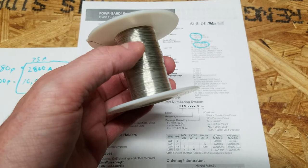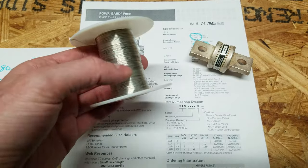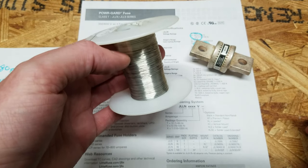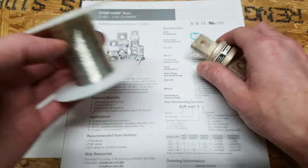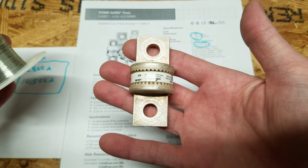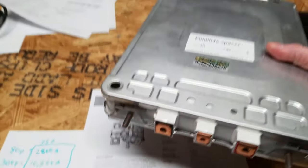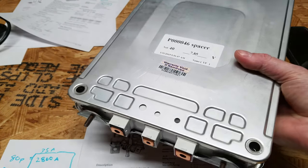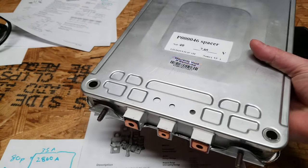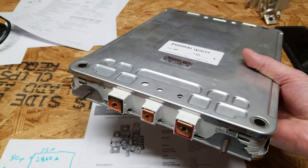You may be asking: why isn't that thin fuse wire good enough, since those fuses would blow before the main fuse? That fuse wire should never be your first line of defense in short circuit protection — you need a properly sized fuse as your first line of defense. It's also important to remember that not everyone is using 18650 cells; some people are using big EV batteries like a Nissan Leaf generation 1 battery pack, and the short circuit capacity of those is unknown and not something you want to test.